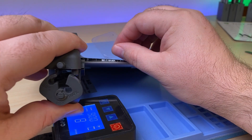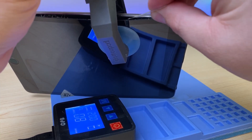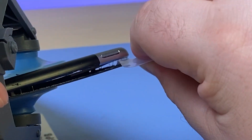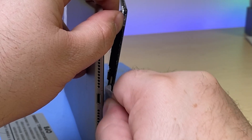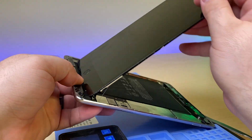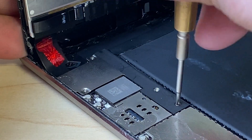When you're dealing with a Wi-Fi issue, most of the time all you have to do is pull the chip, re-ball it, and solder it back on — it doesn't have to be replaced. There's a little bit more involved as far as prepping the board for receiving it and fixing any pads that might have been pulled in the process. But overall it's a pretty standard repair for those that get into this type of solder work.